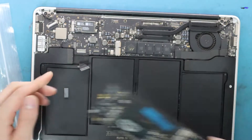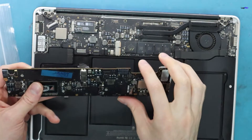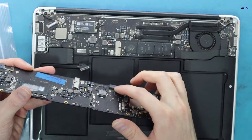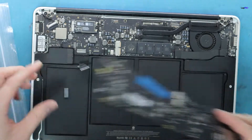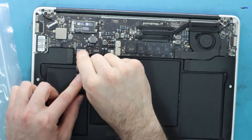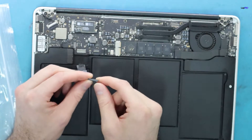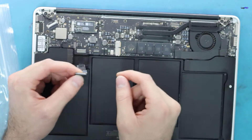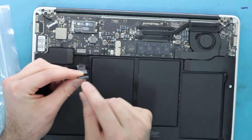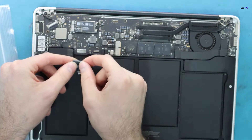For reference, this is basically what it's supposed to look like. It's supposed to have this little piece that just goes on here. You can see how there's a solder piece here — this is soldered right here to the plastic. You might think we can just plug this in and solder it and it'll be totally fine, right? No. If you see here, this is actually really interesting — the pins are actually exposed here. There are some metal pieces here that need to be touched and soldered there too.